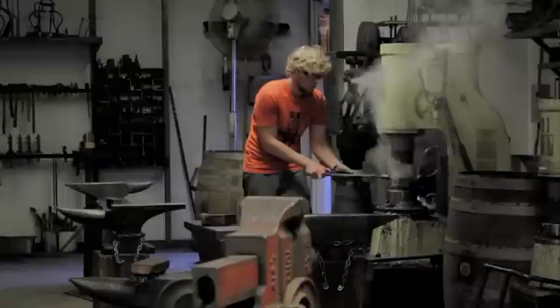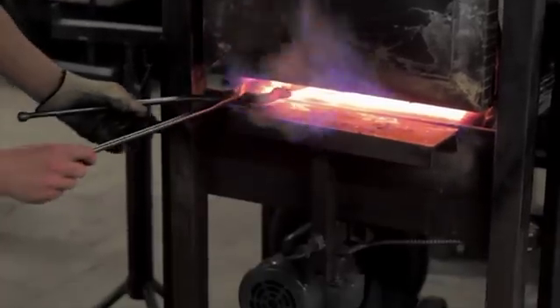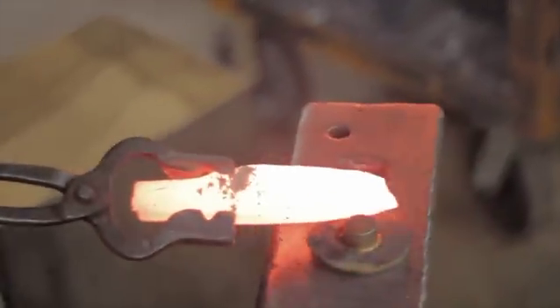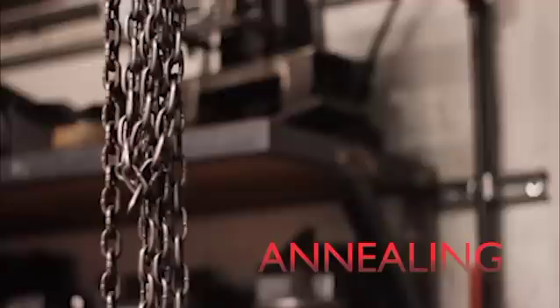After the long and tedious process of shaping the steel into a knife, it is finally time to firmly seal the crystal structure back into place. After putting the knife into the forge one last time to loosen up the squashed atoms and crystal structures, its composition is tested by touching it against a magnet. If it sticks, the steel has the pearlite crystalline structure due to its magnetic field, meaning it is below the critical temperature of 1335 degrees Fahrenheit. The magnet does not stick, confirming austenitic steel — the steel has passed the test and can be cooled down in the process called annealing.